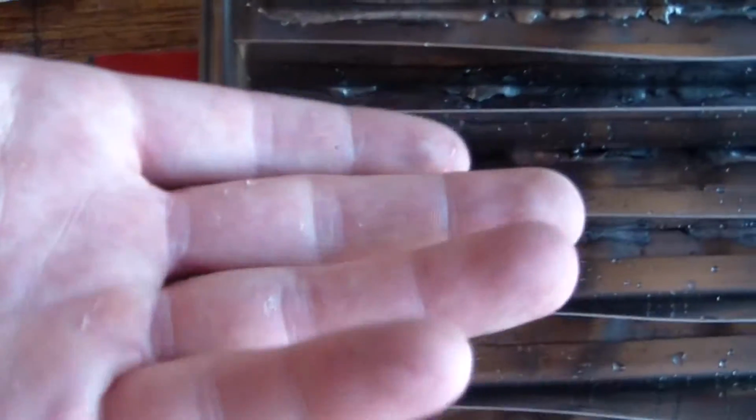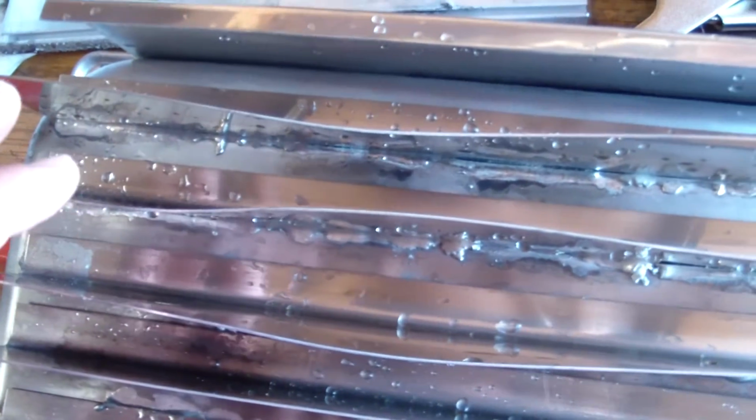Initially I had the thing kind of leaned back so that I would be able to solder down in the divot and try to get a good puddle. But I think what I found out later on was it was better off to keep it level. Because my liquid flux would just run away, and with the warping of the bottom, it left these pockets and holes where the flux would just run away. So it was a big problem.